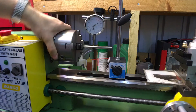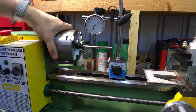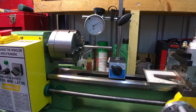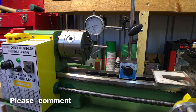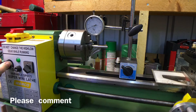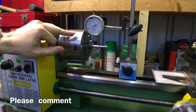As you can see, the needle's barely moving now — we're down to a hundredth of a millimeter, which is pretty good. I've been working on it a little bit off camera and got it down to basically zero runout, within a hundredth of a millimeter. I'll just tighten up the nuts on the back. That's basically what I get my three-jaw down to as well, so I'm pretty happy with that.